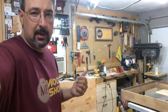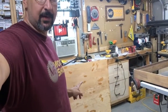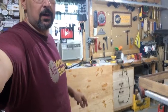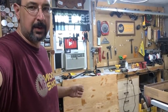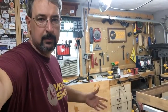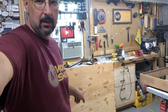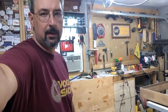So this display case, I'm waiting on the epoxy to fill on this backer board, and then I'll be sanding it smooth. On this backer board there's going to be a giant sticker, a mural of Carl Erskine, and it's going to be covered with a big mural. So that board right there has to be flat and smooth so that sticker lays on right. All these little wet spots that you see are a little bit of epoxy and some wood filler.